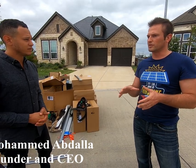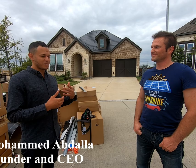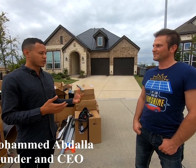Why is producing on the south and west sides versus non-producing on the north a good deal? Solar power is based on sunlight, and the north-facing roof in the northern hemisphere is very bad for performance. You want to put panels on your south-facing roof. In states like Texas where it's super hot, it's great to have panels on the west-facing roof because it clips your peak usage during the summer and reduces your bills — it has a lot of value during those late summer afternoons when you're at peak demand. You love roof planes that have good sunlight exposure and the north isn't recommended.